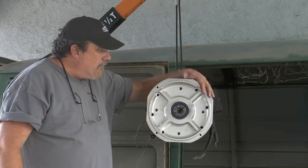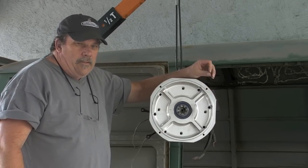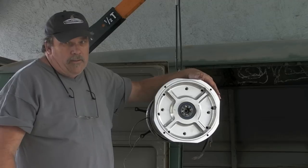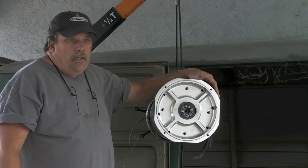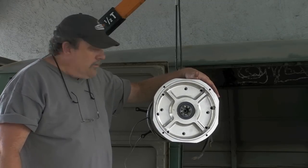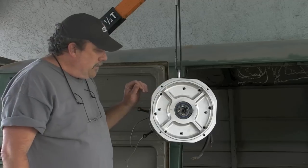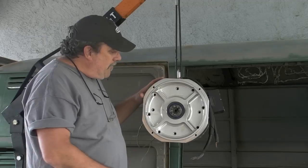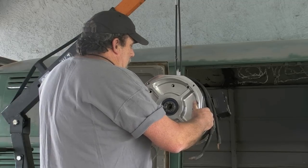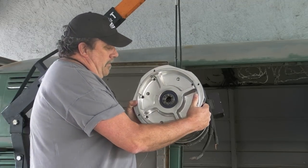This is a good quality adapter plate that you can go out and buy. I really don't think you can build one or have one built for less than what you can buy this one for, and the quality still won't be as good. This is a one-piece unit — what I call a slip-fit adapter plate. There is no taper lock that clamps down on the shaft. It slides onto the center piece here and literally just slides off that easy.